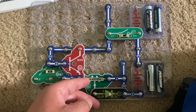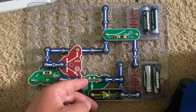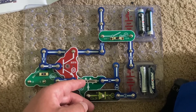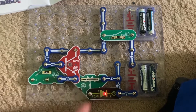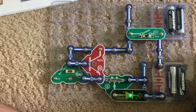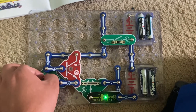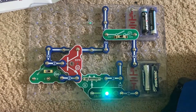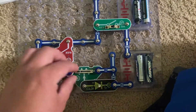Now I'm going to gradually move the RV2 lever to the right and the color LED gradually dims, but red is the last light to go out. Red requires the least energy of the three colors. Now for the second part, I'm going to move the switcher to the left, and the LED is now brighter and you can see blue as well.